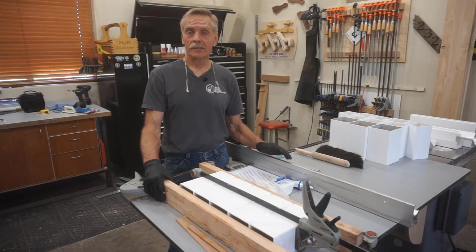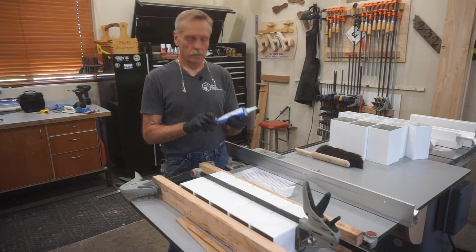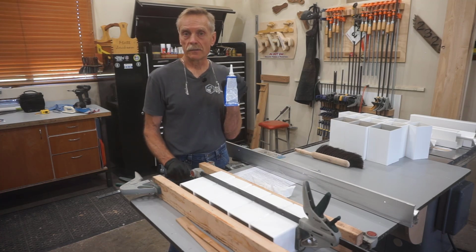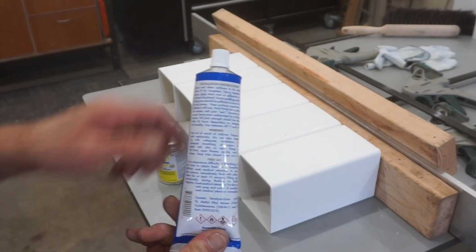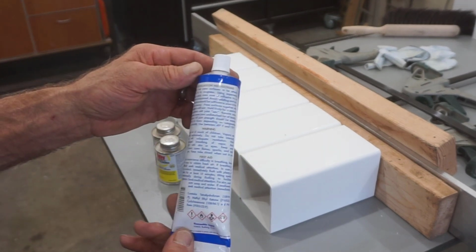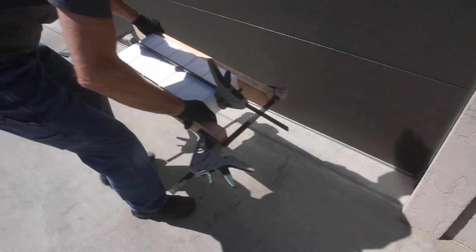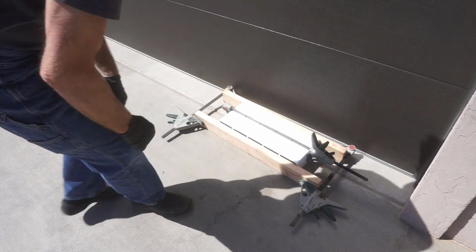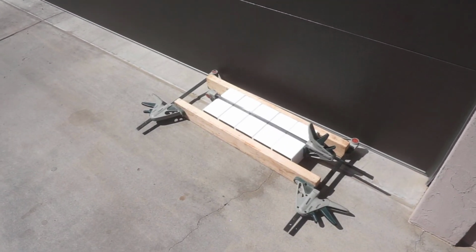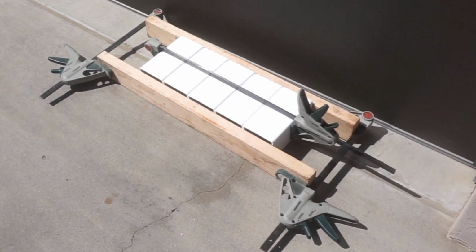Once you get to this stage, it's time to take either a hike or a nap to wait while the glue cures. Instructions on this adhesive say to allow it to set for 5 minutes and remain undisturbed for 30. I don't know about you, but 5 minutes is easy, but I may become disturbed by the time 30 minutes is up. Of course, cure times vary with temperature and humidity, but I'll speed things up dramatically by putting this assembly out in the hot summer sun for a while, where I think a good hour's cure time will be plenty to proceed with the build.